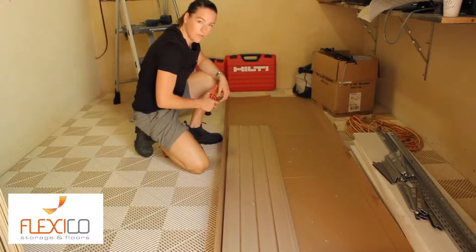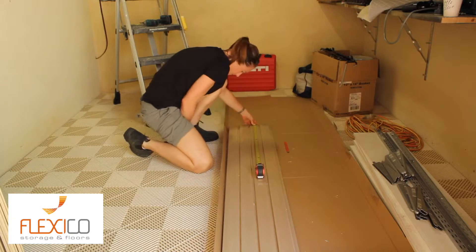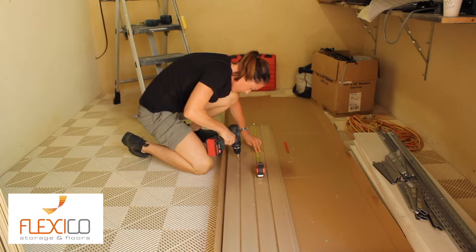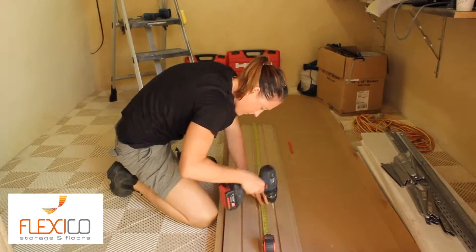Let's get into it. Helping me today to put the wall up is my dad Bill. For those of you on the east coast of Australia, this installation is a lot quicker as you have stud walls. In WA we have brick walls, hence the pilot holes. Still, it's a good thing to space them out and measure to make sure you stay clear of power points and pre-existing holes.